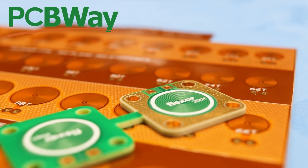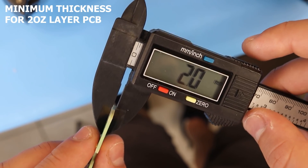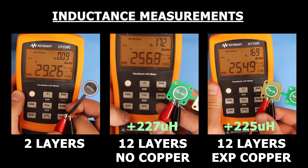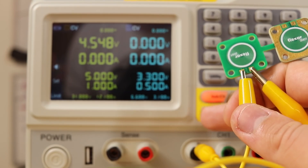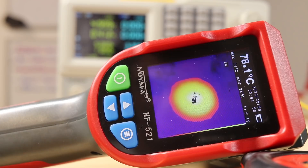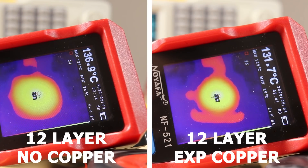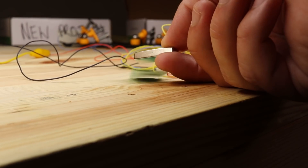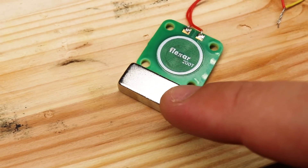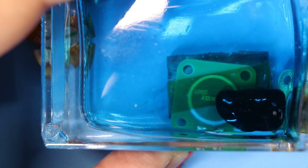Thank you PCBWay for sponsoring my new PCB coils. Let's start by testing the 12-layer coil. This board was manufactured with a 2 mm thickness. The coil's inductance increased to 255 microhenries because of the new extra turns, but its resistance was a little bit smaller than my initial 20 ohm target. So at a constant 5 volts the coil was drawing more current — I was afraid this would make it too hot, but it still managed to fit within my current Flexar temperature range. The exposed copper sample kept it a little cooler without affecting magnetic field strength. The 12-layer coil is 5 times stronger than my 2-layer coil, making it the strongest PCB actuator I've ever made. Adding a steel back core increases the magnetic field to 16 millitesla, which means this could work much better with ferrofluid.